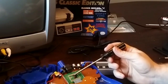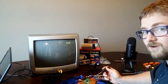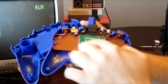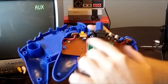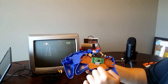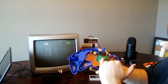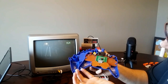But there's our glob top attached to a board where it's soldered in. So, and that board is not much bigger than the board was in the NES Classic bootleg, as you can see. So once again, this is the guts of the entire operation. It splits out from here and goes to the board, which has the controllers and the AV and everything on it. But all the magic happens here. Once again, we have a Nintendo on a chip, I'm assuming, on the back. We can't see it because it is soldered directly to the board underneath. But then we have our glob top, so this is the essence of 118-in-1 cartridge, and that's it.